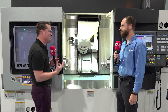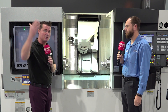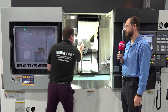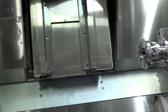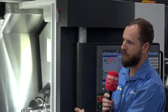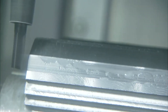The technology these days is fascinating — knowing how much we can do in one machine. Something I want to address: you said 3+2 or true 5-axis, and the head on the inside rotates to work on both sides. The audience sometimes asks: are we losing rigidity, accuracy, torque, or horsepower? Okuma's build philosophy is to never put too powerful a spindle on a bed. This is a 20-horsepower version and you can get 30 on the main spindle, but they do not offer more than 15 horsepower on the sub-spindle side because the W-axis that comes over to pick off does not have the rigidity for a 30-horsepower spindle there. The milling spindle is 16 horsepower and this machine is capable of using all 16 — you can run the spindle where it needs to run and you don't have to back off.